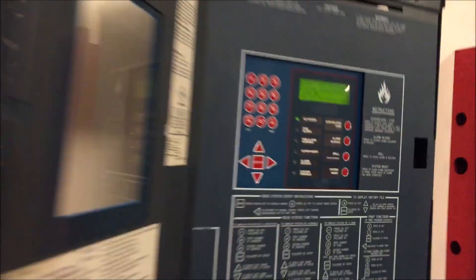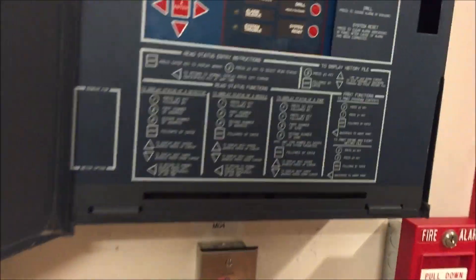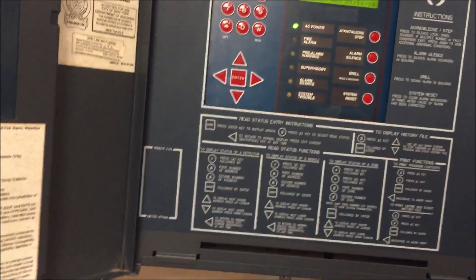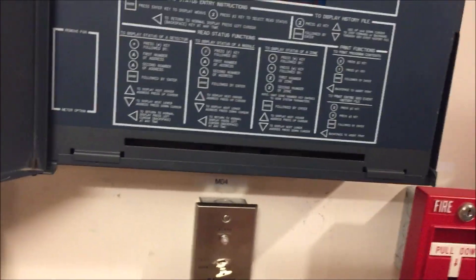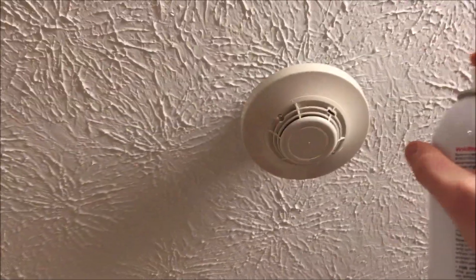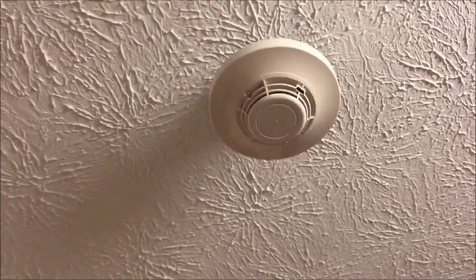The sync module is clicking away, everything's going. We will reset. Now we're actually going to solo test the smoke detector. I'm going to put just a little bit of Solo in at a time — I'm not going to totally drench it — and you'll see the pre-alarm feature come out and it'll show the concentration. We'll start by just giving it a little blip.